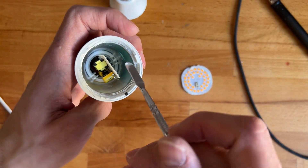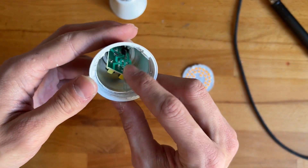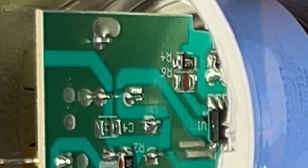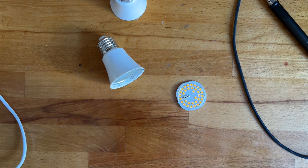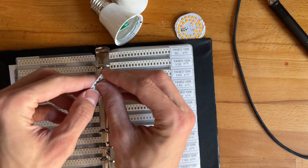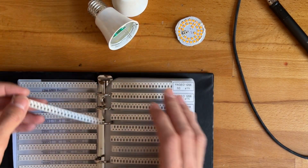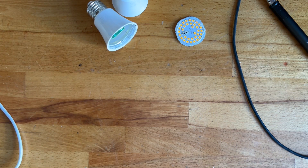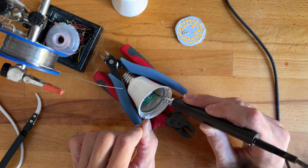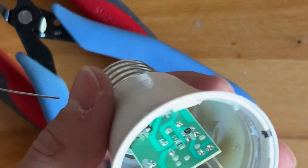I think we'll leave this second one as-is externally — I don't want to damage the plug. The sense resistor on this one also reads 2.4 ohms, so I'm going to swap it the same way — adding about 4 ohms, same as before. We did 5.1 ohms on the first one, so let's do the same here. And then we'll be done. You guys should continue watching videos on my channel without ad blockers — please and thank you.